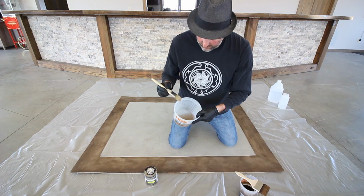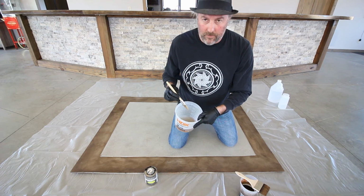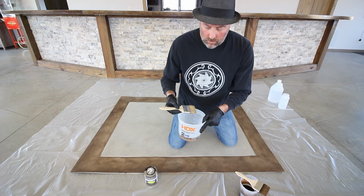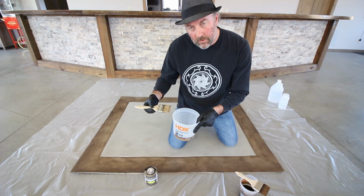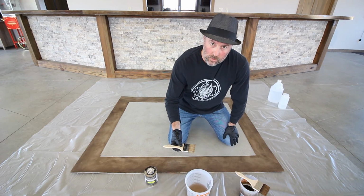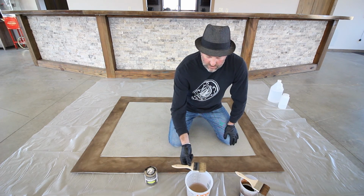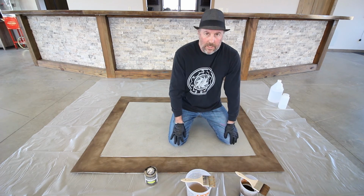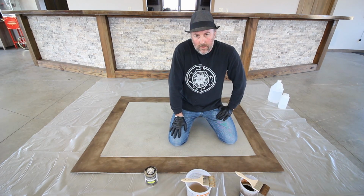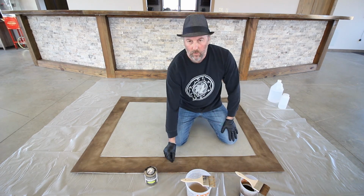And then after you're done, you follow with denatured alcohol. It's going to be clear, it's going to give you a little bit of color, but you're not going to have a whole lot of color lift or removal. And you're going to do the same thing, dip, drip twice, lift, start painting. And just take your time, big swooping circles, cover the whole thing from edge to edge, and just make sure you make it clean. If you do this and you have a couple brush marks you can't stand, redo that area, but redo an area. Don't just redo just that one spot.